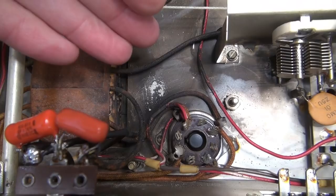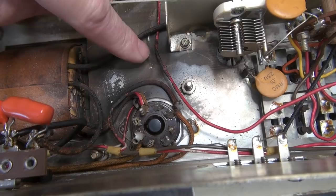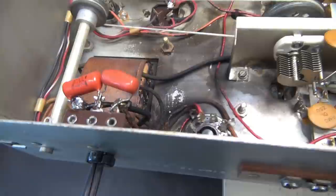All the smoke and heat went in this direction because you can see some of the wiring is also charred and a little bit melted. Probably what caused this, if you look at the schematic, is that this radio never had a fuse. So when that shorted out, the 120 volts had to have somewhere to go and just burned things up.